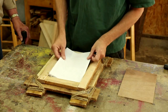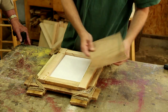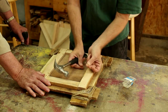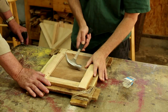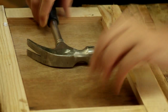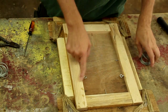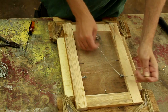Then I just take my picture and put it in. You can use cardboard or whatever you have on hand. I have a thin sheet of plywood that I've cut to size. I just take a couple of brads and nail them in — it doesn't take a lot. Just maybe one on each side is plenty to hold it in. I usually just put a couple of eyelets in the sides and then use some picture-hanging wire threaded through.